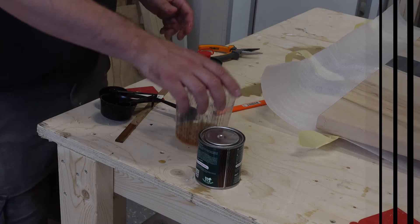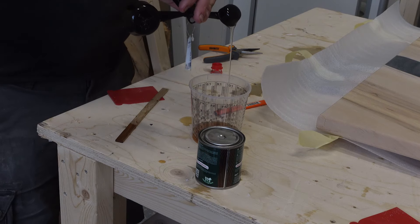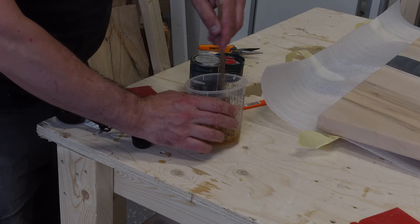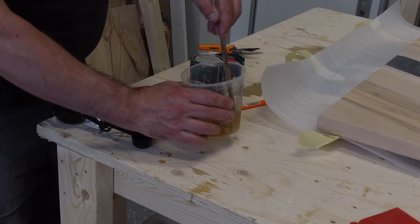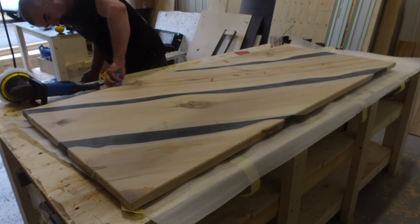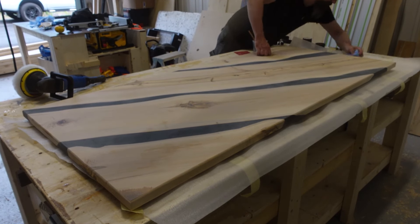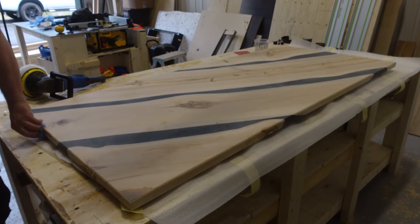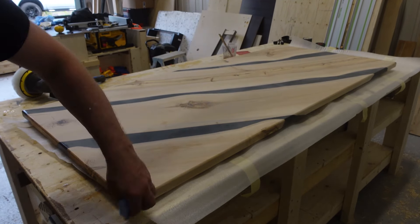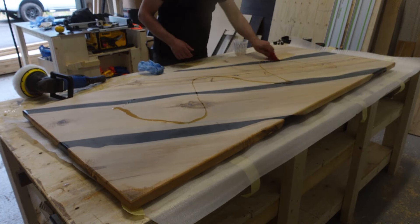This is not sponsored, but after watching a Wood Whisperer video on different finishes, I wanted to try out Natural One Coat, just to get a feeling of how different it is to Rubio. The process for mixing and applying it is 100% the same as Rubio. The smell is actually more appealing — if you've used Rubio, you know the smell. I think this was better in that sense, but the end result feels exactly the same. So I will probably keep using Natural One Coat in future because it is cheaper, and it feels like pretty much the same product as Rubio.